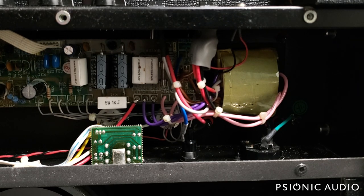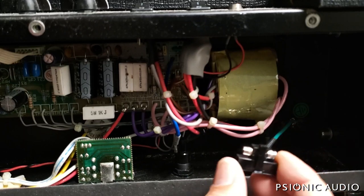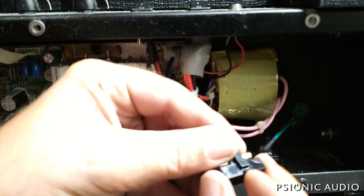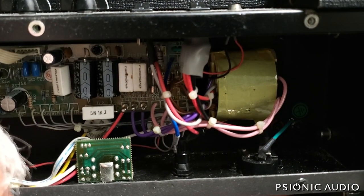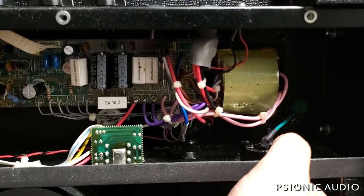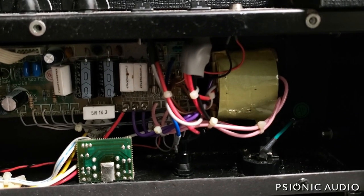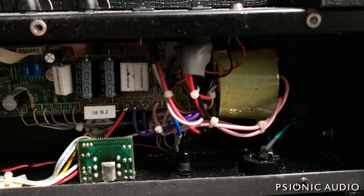I'll go into my big box of fuses, put the replacement back in the holder, slide the drawer into the IEC connector with the tab up — that's the tab where you press with the screwdriver. Let's plug a power cable in and see if that 5 amp HT fuse did any damage whatsoever.